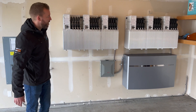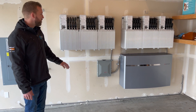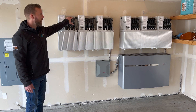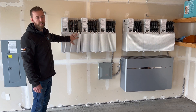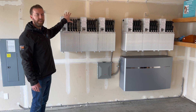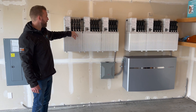So here we have 30 kilowatt hours of battery storage. What makes Enphase a little unique from the rest is that it integrates their IQ8X inverter that's special for the battery, and what this allows is no high-voltage DC wiring. The DC wiring from the battery goes straight to the micro, converts it straight to AC, and then out to a panel for your home.